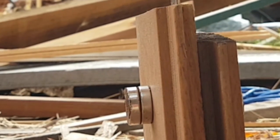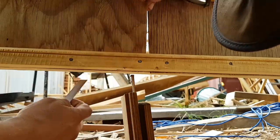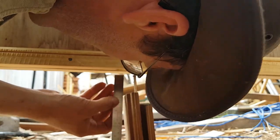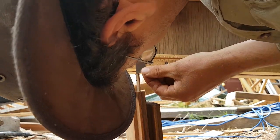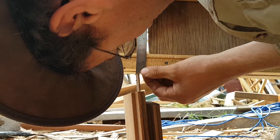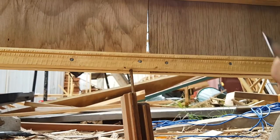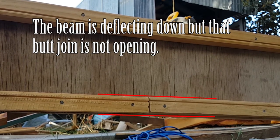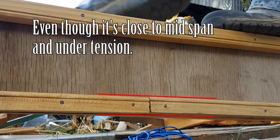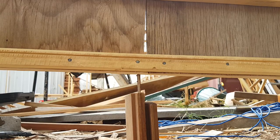What I'm using for our gauge is three bits of wood held together by some door magnets, which will allow the centre piece to slide down when I'm on top of the beam. What do we get? 10, 11 millimetres of deflection. Let's be conservative — let's reset that. Three times out of three it says 11 mil, so I reckon we'll call it. The beam works.